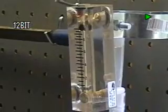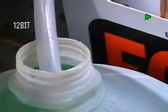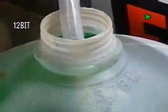Now you can run this at 18 to 22 amps continuously and it does not overheat or boil. It will give you — as you can see as we zoom in — output in the 4 to 6 liter mark, bumping to 10 as you can easily see. And going down below, we can see the outbound hydrogen coming out right now. To prove that it is hydrogen, we're going to light it off — it is hydrogen.